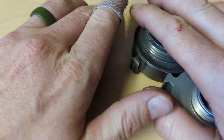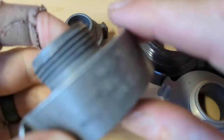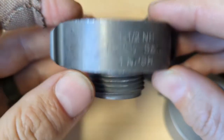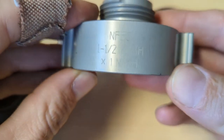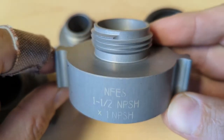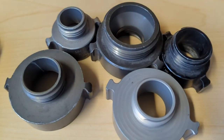Again, this will get you through 99%. Your inch and a half to inch, inch to three-quarter — that's mainly what you're going to see and use. And you can quickly identify if there is writing on the side: one and a half inch national hose to one inch national pipe straight hose — yep, that's the normal adapter. And if you came across a coupling where both ends were national pipe straight hose, you'd automatically know this must be some kind of adapter, because that should be hose and that should be pipe — so this is trying to go from some kind of iron pipe connection to our normal one-inch hose connection. Get out there, get hands on. I hope that helped and didn't make it more confusing. Good luck — let me know if you have any questions.